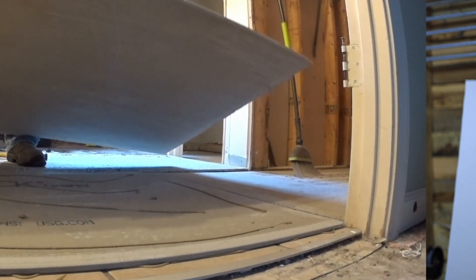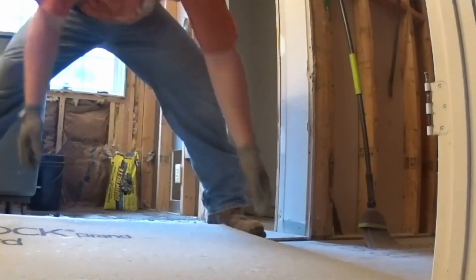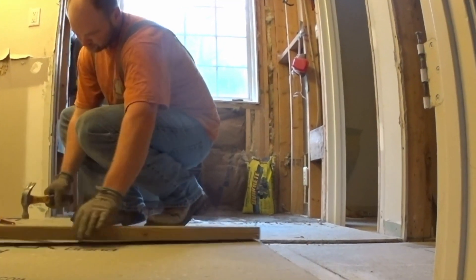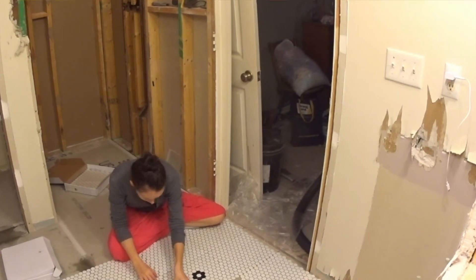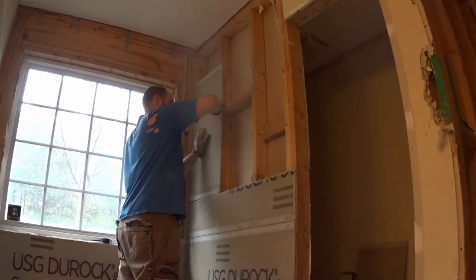The second method is securing a backer board mechanically to your old tile — basically sticking some hardy board or cement board down and screwing it through your old tile into the floor or studs, then building your new tile on top of that. For a floor application, it's still recommended to apply a scratch coat of thinset on your old tile before laying the new backer board on top — not for adhesion, but to fill in gaps and valleys to prevent squeaking when walking. You still need to secure it with screws. For a wall, just securing the backer board with screws should be fine. Obviously screwing through tile isn't easy and does add thickness and cost, but it's a good option if that's not a concern.